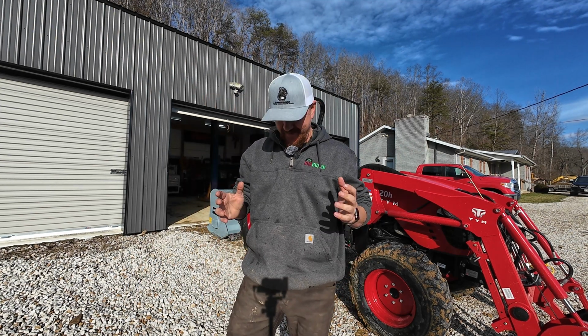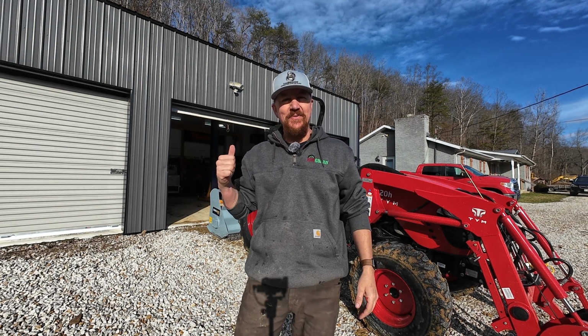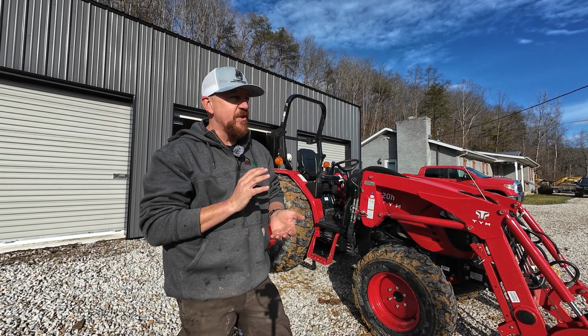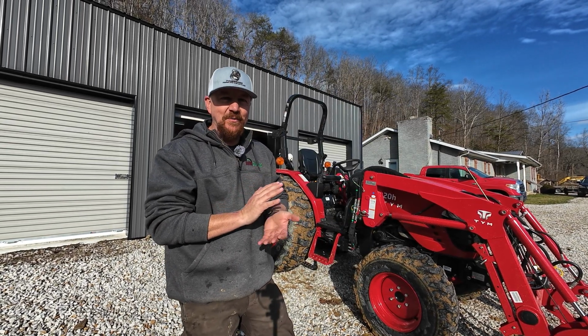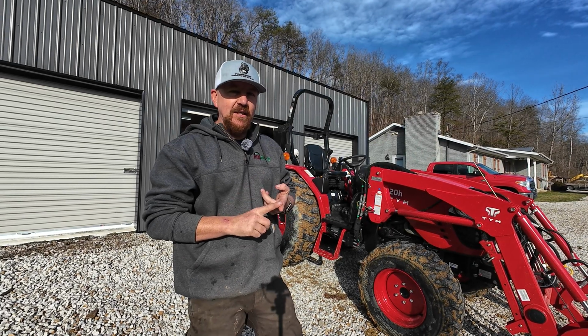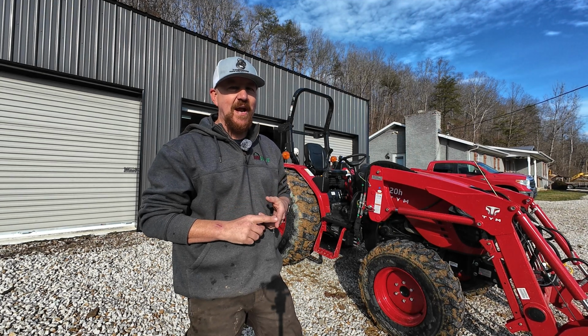And today I was all excited, just getting ready to head up my brand new road and do some mulching. And I got a text from a good friend of mine, Evan, who was watching my newly released Light mulcher video. He said, hey, I think you may need to look at the adjustment on your slip clutch on your mulcher because it's killing your tractor awful easy.